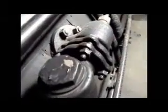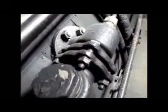And here is the water pipe that flows from the injector and into the boiler. So this is how the engineer side gets water in the boiler. Basically, this in here is a valve that, based on the pressure of the water that flows into here, will force that open and force itself into the boiler under pressure.